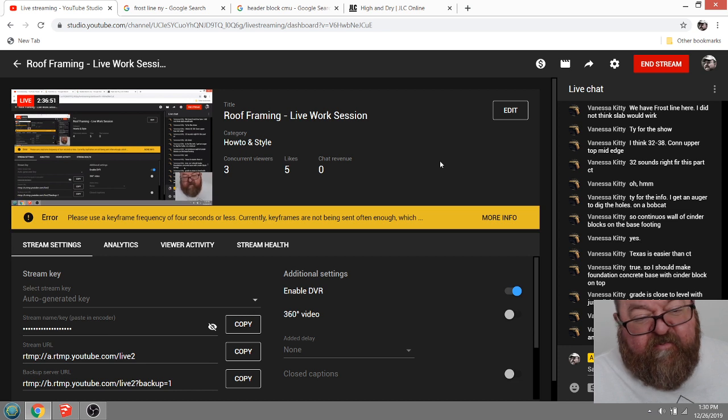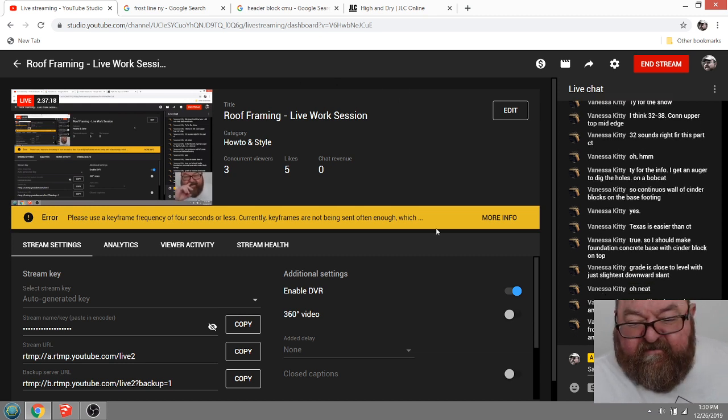And then your perimeter would be closed in. If it was my shop, even if I was going to do those columns, those piers, I would go back and somehow use some metal siding or something to close it in around the base, because you don't want critters going up under there. Rats and such love that kind of thing. They'll go up in there and build nests, and sometimes you never know they're there.